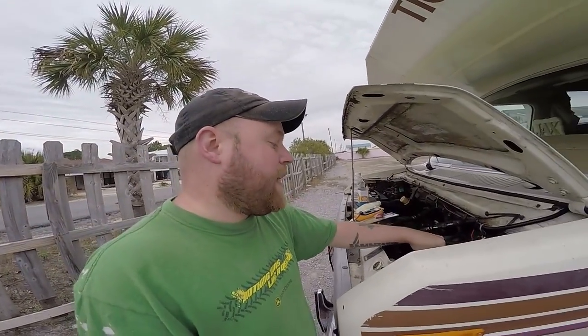Then I've got the other 100 watt panel on top which comes down into the smaller charge controller and goes into that new sealed AGM battery behind the seat — I believe 3 amps max can come in on that one. And then I have the 750 watt inverter for using at night so I don't deplete the main battery. If the main battery gets too low, I can't run things like the fan above the stove or the furnace fan. It was a cloudy day today but I maintained 12.8 volts, so I'm happy — overcast and I still got plenty of battery. When it's sunny I can't even use all the power.